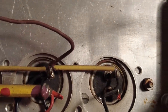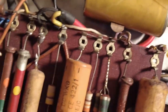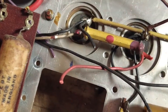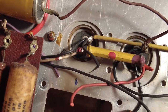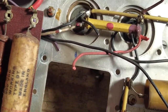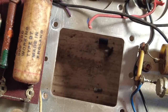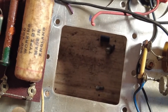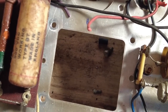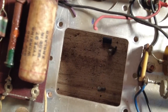But yeah, so we're homing in. There's still a bit more, so we're going to lift this board, and then we can get that output transformer bolted on, and we're going to put that wafer of terminals just back over there to cover that hole, and we ain't got that hole to worry about. And then once we get all that wired up, it's probably looking good to get some fire in its belly.